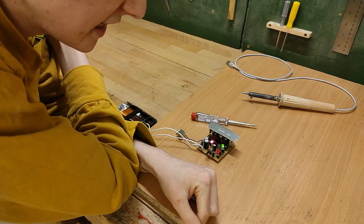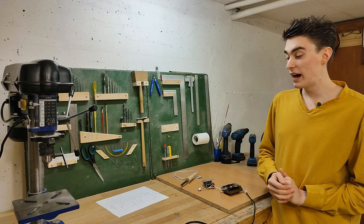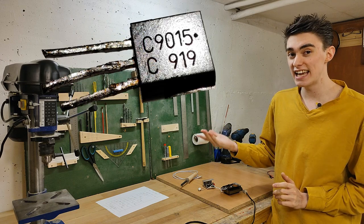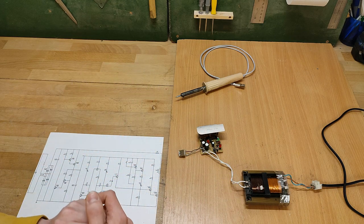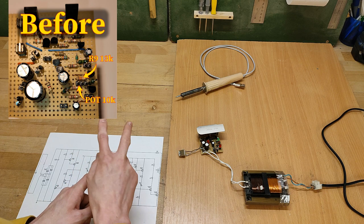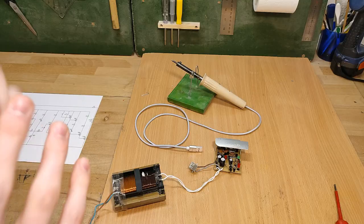I guess I need a little time to investigate. Ah, electronics — never missing an occasion to embarrass me in front of my viewers. Anyway, it's fixed now. Turns out it doesn't work great with the PNP transistors soldered in the wrong way round. And while desoldering them to put them in the right way round, I somehow managed to kill one of them, so I had to swap it for a C9015 instead, which works just as well. The issue with the red and green LED being reversed was just a change I had made during assembly — thinking the 13K resistor was connected to the base of the wrong transistor on my layout picture, I switched it around, ultimately just ruining it instead. Turns out I did use my brains planning the layout after all, though obviously not enough to put the transistors in the right way round.